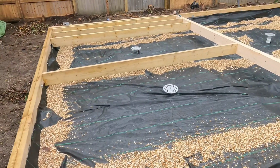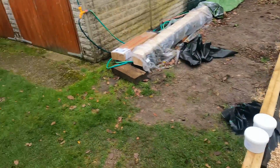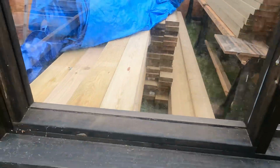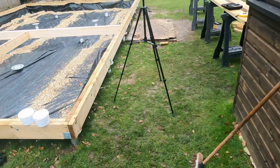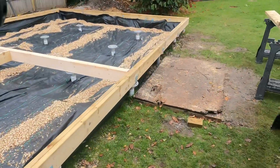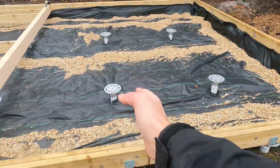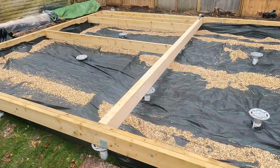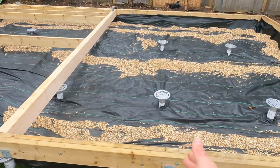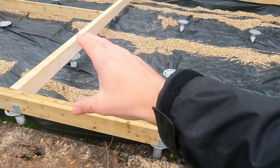Right guys, so like I said, now the next stage is just to infill all these joists. I've got to get the rest of them out from underneath there. They're all down there, and then I'm going to need another 16 joists just to fill in this bay. But I'm going to put another glulam in here, because originally it was going to be 3 bays. That's why I got 3 glulam beams. There's another 2 over there. But I'm going to probably break it up and put another one either in here or on there, going across there, just to break up the overall span.